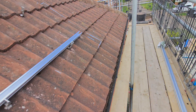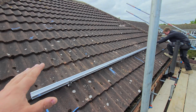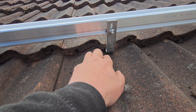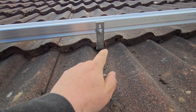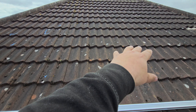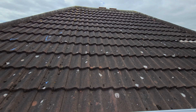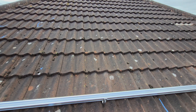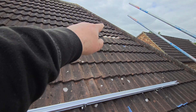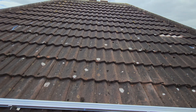Nathan's just setting out for our next row of hooks and the rail to go on here — we've got this bottom railing all ready. Same principle: the hooks are sat off the tiles so there's a little gap, no compression onto the tile below, ground out above so the tile above sits flat and no insects can get back in. This section is going to have four panels in portrait and then another three above it. It's a tight roof space — it's a hip shaped roof and there's not a lot of real estate to work with. The guys are cleaning off a bit of moss, getting the rails on: lift the tile, screw the hook down into the rafter, grind out the shape, pop it all back together, then load the panels on.